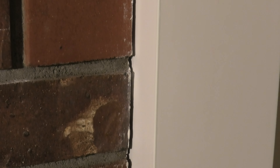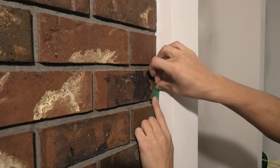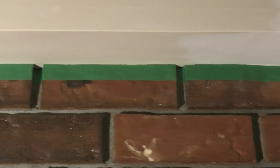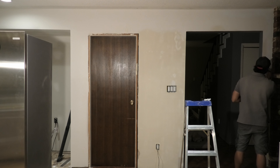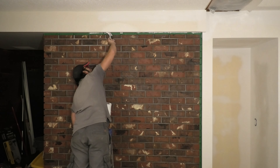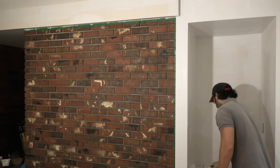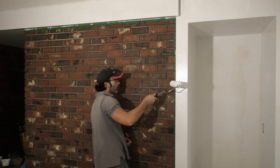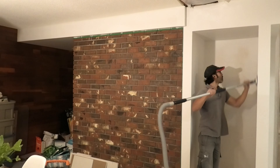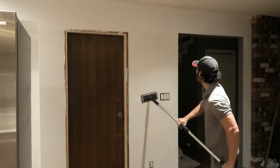Here's the final pass. Now I'm going to mask off the brick edges to get it ready for the primer — kind of a tedious chore, but if you get paint on brick it can be a real pain to get it off. Then moving on to the rolling, using a 9-inch roller with a 3/8 nap, rolling on two coats of Bullseye 1-2-3. In between the coats you have to sand — this is especially important after the first layer of primer, where all the fiber on the surface of the drywall paper gets set into that unpleasant gritty feel. You want to smooth that out before rolling on the next coat.